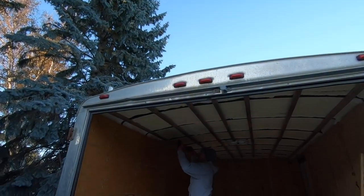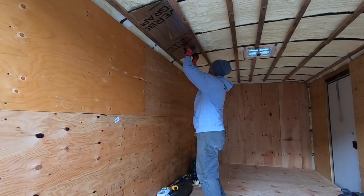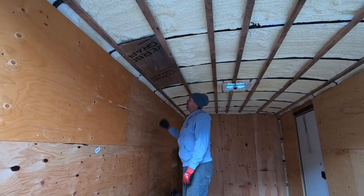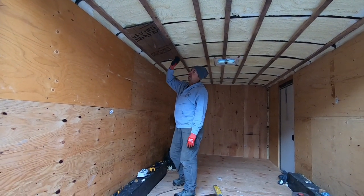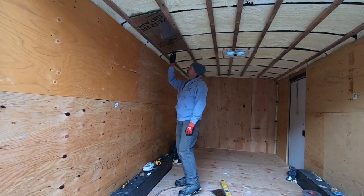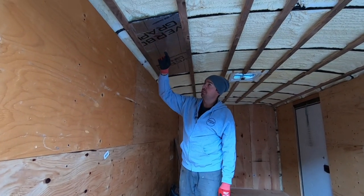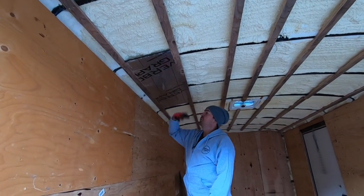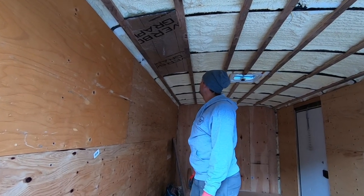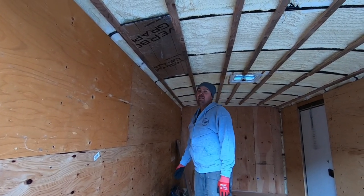There we go. Now we just push it up here and squeeze it in. You can be over-cut a little bit. And that's it. So if I need to fish wires through here when I have my paneling on, I'll just drill some holes for my puck lights that I'll be putting in. Then I can just cut the foam out, the light will slip in, and I can take fish tape and push it through to get my wire to the next spot. We'll show you that in the next video once we get into the electrical stuff. That's sort of how I'm going to do this and just add that extra warmth. I'm going to keep going down each row and get all this done.